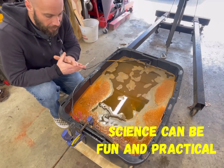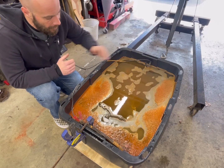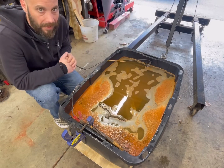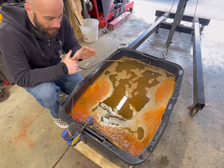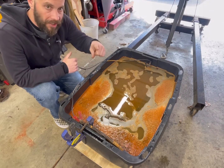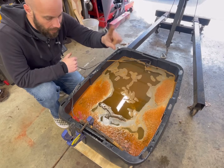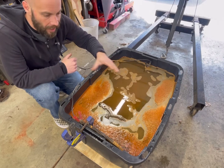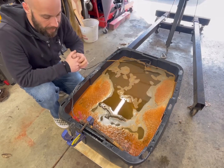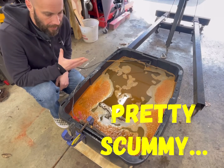One good idea is to reverse this. Since I am pulling from the furthest point of this block, you can actually take the plate, put it over on the other side, switch your leads, and pull the opposite way. When you have one of these old chargers, watch the amperage gauge — you want it pegged as high as you can. I noticed it was high and then it dropped, which told me it didn't have enough current going through it. So I added a little bit more solution, mixed it up, and the needle pegged again. The higher the amperage, the better it's actually going to work.